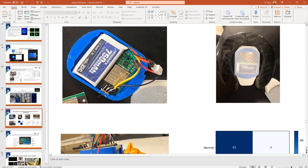So that means all the devices are 3.3 volts, and you only have like 400 millivolts to drop, which is pretty challenging for analog design. What does that mean? Because you got battery power supply as 3.7 volts, right? And your devices immediately need 3.3 volts. So there's only like a 400 millivolts loss allowed through the regulator. But usually the regulators, for the ones on Arduinos, are losing like 1.2 volts. It's like 50 cents regulators. So all these analog designers in TI, in Analog Devices, are smart enough to design what's called an LDO, low dropout regulator. Let me show you.